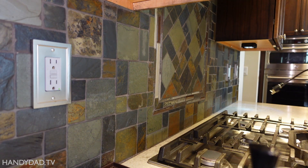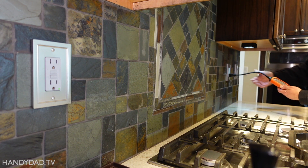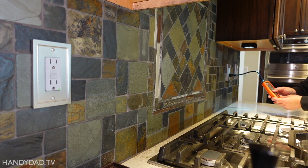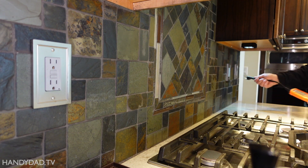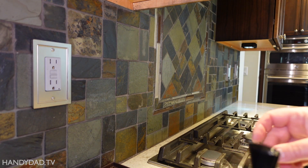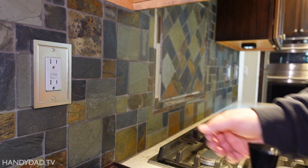I'm going to do the same thing at the GFCI. In addition to testing with the test button, I can test the GFCI remotely by plugging in this little device here. It has a button for GFCI testing and it passes a very small amount of current to ground — that's what causes this to pop. You heard the click, and that's back on.